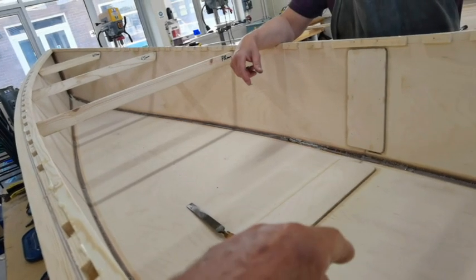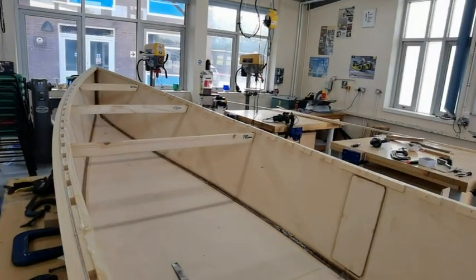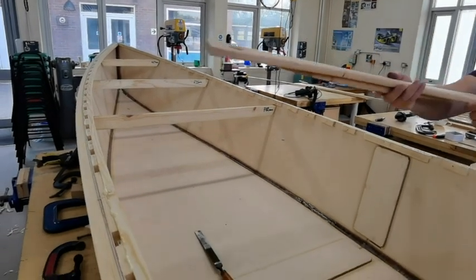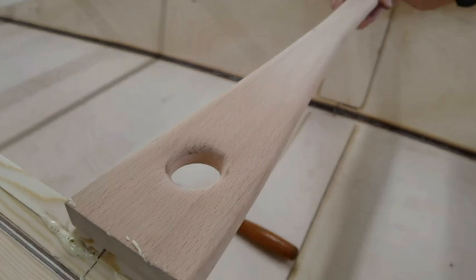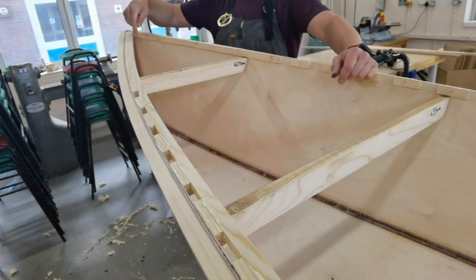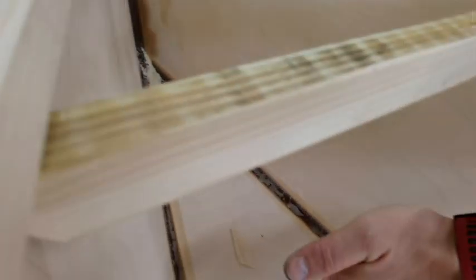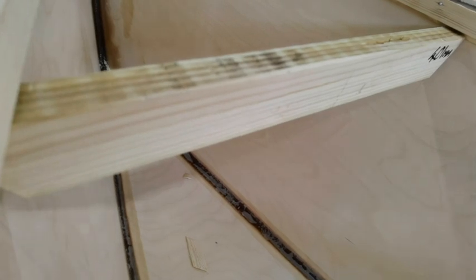The intention is still to finish all this beautiful wood with the varnish. You've got the other side to fit - and virtually, there's only a few things left. There's two seats. Mark, I made this yesterday - this is the little thwart that fits in the centre there. I put a strengthening piece on the back of it, and that will fit in the inside across there as a bracing piece. I'm going to use another piece of beech like that to make a handle that you grab either end to carry it with. There'll be a little knee piece - an infill piece of mahogany, a little triangle that'll sit in the end. And then I might well make a bulkhead part with an airtight pocket as a flotation thing. But those are all sort of finishing things - in an hour or two, this will be a canoe.